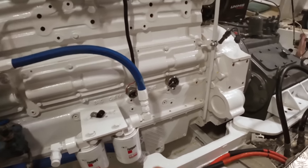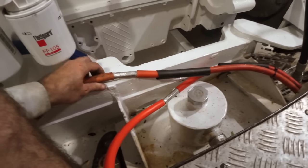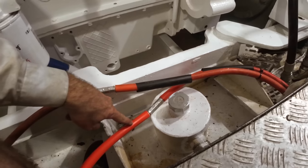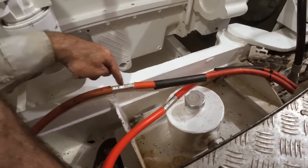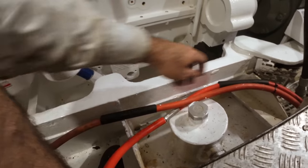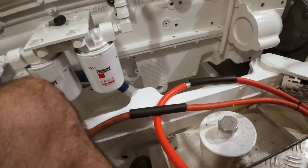While fitting the oil sender, I tightened it too much and put too many horsepowers into the 7mm nut and snapped one off - so that's not going to work. I've got another one on order - takes 14 days to arrive. We'll leave the broken one in and not have the electronic oil pressure sender running for the first few days, but we'll still have the manual gauge so we know we've got oil. The camera ran out of batteries, but I'm starting to extend the battery cables. Old cable, new cable, joiner - these are 95mm square cables, with a big chunky bit of heat shrink. Time to heat shrink these and start extending them over the engine.